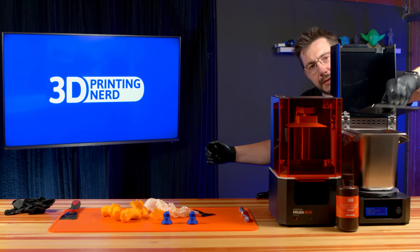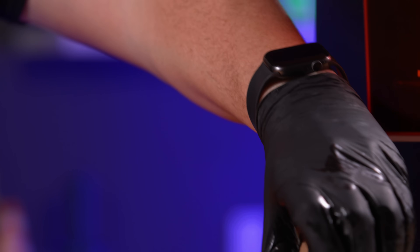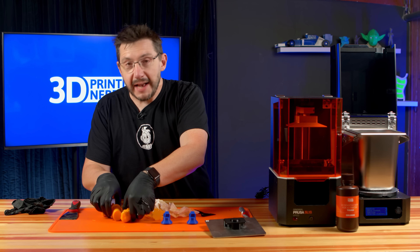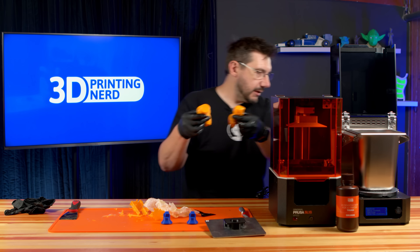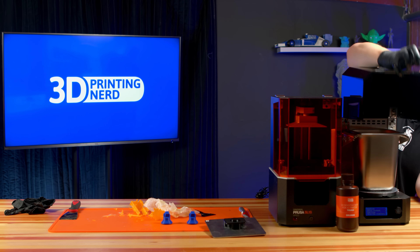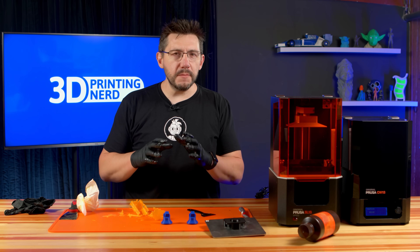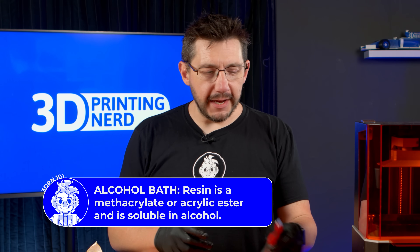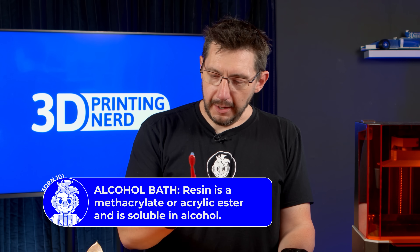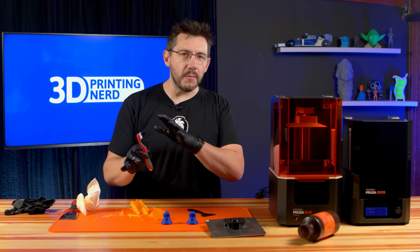This is the top where you can attach the build plate, just like with the Prusa SL1, but we opted not to do that. There's a basket on the inside, so I can just toss the models in. That's going to go for four minutes — just the default time. When it comes out, it should be washed enough. But just in case, I do have my electric toothbrush to get any pesky resin that might be in the crevices on the model.